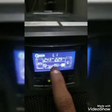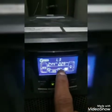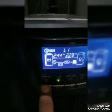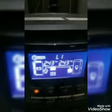Right now I will shift the load to bypass. It means I have to turn OFF this inverter — the middle box — so that load will be shifted to bypass. There is one key for OFF — this one, OFF and ESCAPE. I will push it, press and hold. Inverter is OFF and load has shifted to bypass. You can see the block diagram of that UPS.